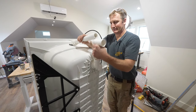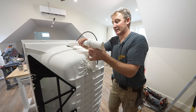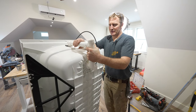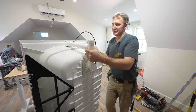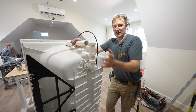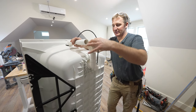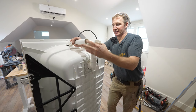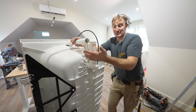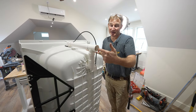We got twelve and a quarter. Now if you did have issues with room, you could do it this way — another alternative where you have your fitting sit sideways if you don't have the height in your floor. Then you're going to have to obviously have another elbow that points down, but that gives you more alternatives because you can bring it out and extend it as far as you need, then drop down wherever you need to. We're just going to do the traditional method and then once we get the tub in we'll connect this to our existing piping.